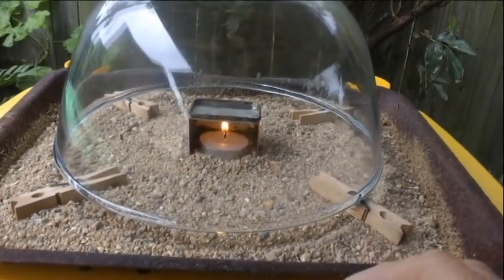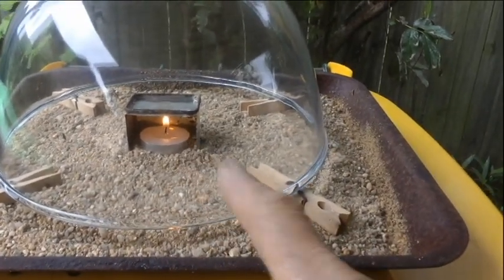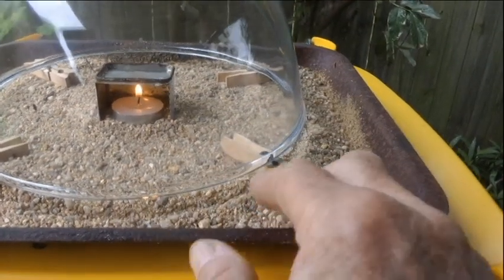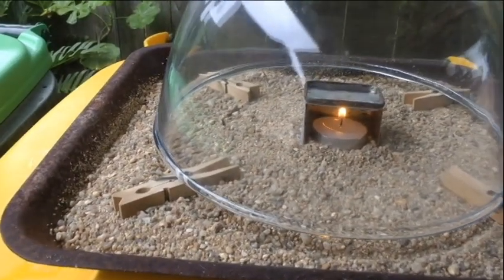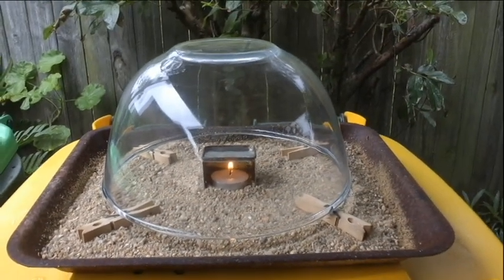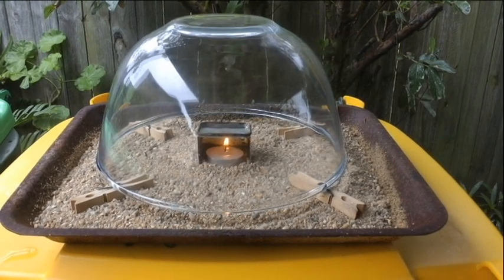It's just a way of recovering your burnt-off mercury. It goes up here, condenses, falls back down into the sand, and then you pan out the sand to get your mercury back. Just a basic simple retort. Hope it helped you out.